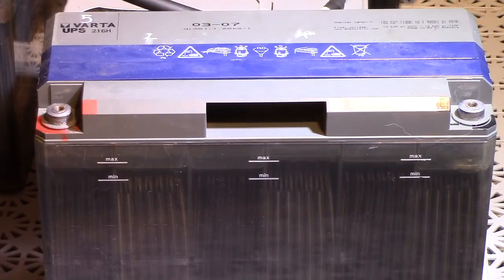However, I need to research what actually has caused this and what the performance of the battery is like now that this has happened, because the electrolytes of the different cells have been mixed and the levels were not entirely matched. Indeed, all cells except cells 4 and 6 from left to right measured kind of poorly. So, there certainly is something funny going on. What that is, well, that'll be the subject for another video.